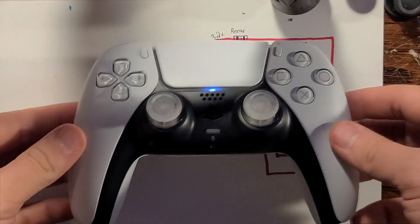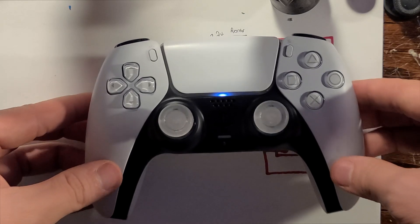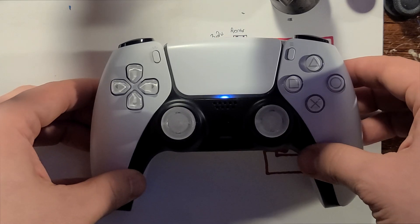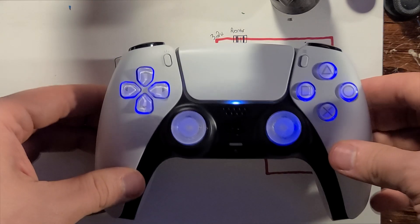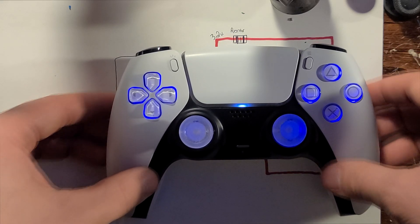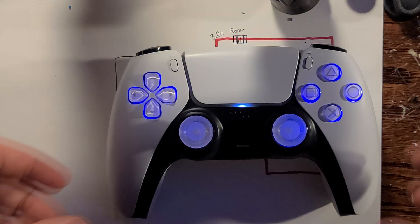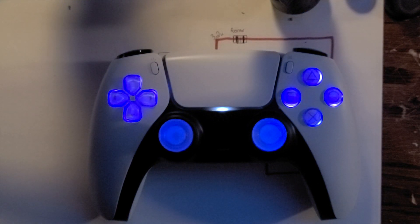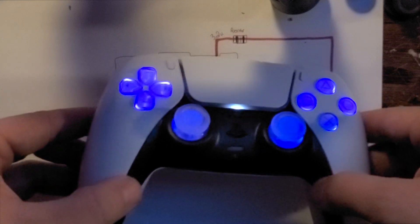With that said, we can go ahead and close it up. The controller is pretty much finished — everything's working perfectly. All you have to do is touch the little area where you put your chip and your LEDs will illuminate. With this feature it's a lot more convenient to turn off and on your LEDs because you'll save a little bit of extra battery life. I really like this little chip — it's pretty cheap and I'll have the link in the description below. Now, the LEDs I installed in this controller are UV LEDs. With this camera they look really bright blue, but in person the buttons actually look kind of purple and the joysticks look purplish-blue, giving a really cool effect.